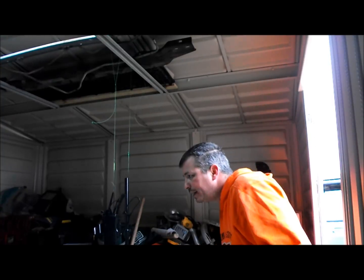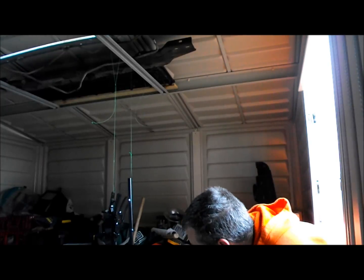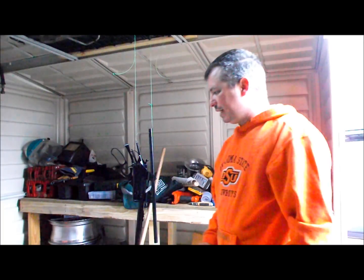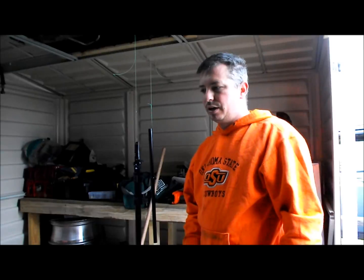Just keep the coats light and it won't run. I'm going to wait another 10 minutes, come back and give it a third coat, and see what it looks like — see if I want to put more on or just leave it at three. This is my third coat and it's probably going to be my final coat because it's pretty dark at this point. I'm going to spray it down and then wait about 24 hours and let it dry. They're usually pretty dry to handle within a couple of hours, depending on outside temperature and humidity level. But you don't want to use it for about three weeks after you put the last final coating on — it has a cure time.